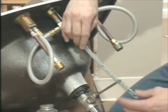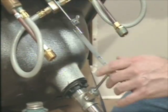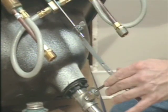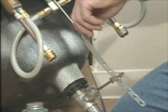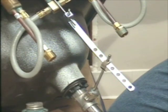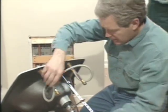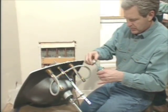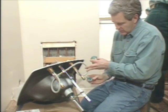Not exactly perfect — let's move up to the third hole and see how that works. Okay, complete down position, about there. Tighten it down. Yeah, that seems to be working pretty good. The last thing I want to do is hook up these supply tubes to our valves. Get a little pipe dope on here. It's a lot easier doing it now than once the sink is in place.